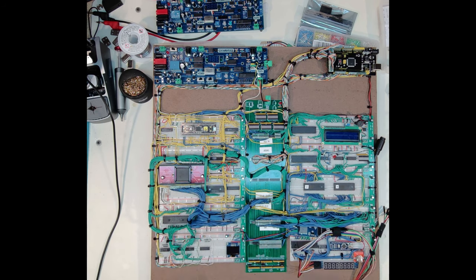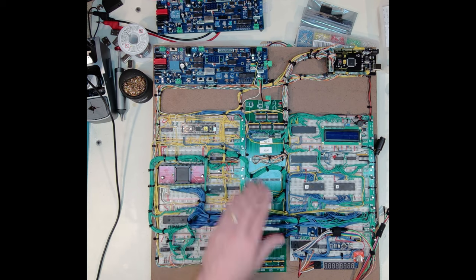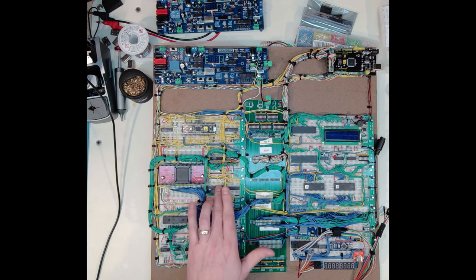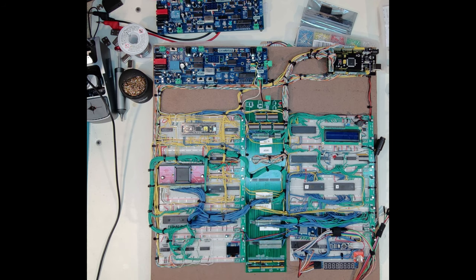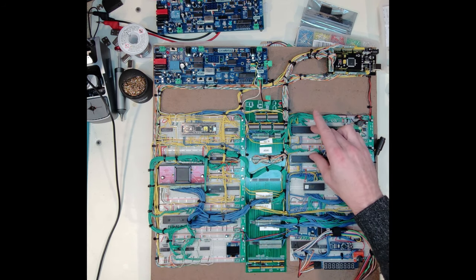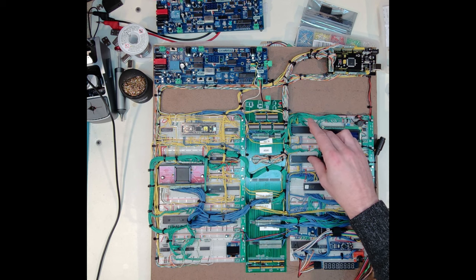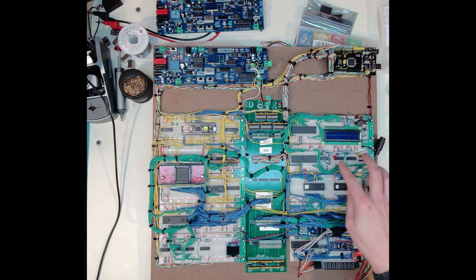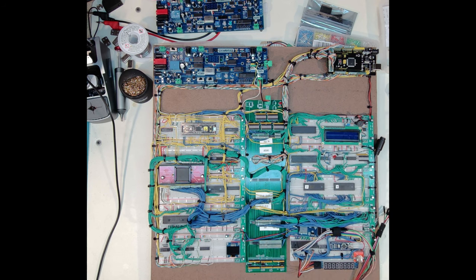You know, I have everything from my clock generator to bus controller. I have a math coprocessor. I have a priority interrupt controller or a programmable interrupt controller. I have my peripheral PPIs, programmable peripheral interfaces over here. I've got my RAM and my ROM. I've got keyboard input, a two-line LCD output, SD card, and a bunch of other SPI type of functionality, some initial coding to make it work and do some testing with it.